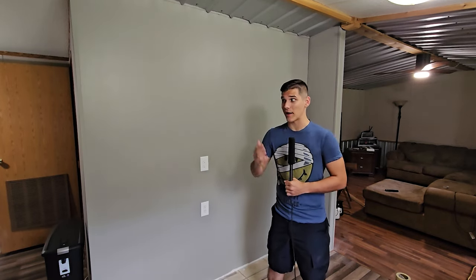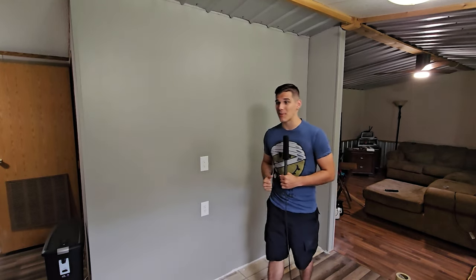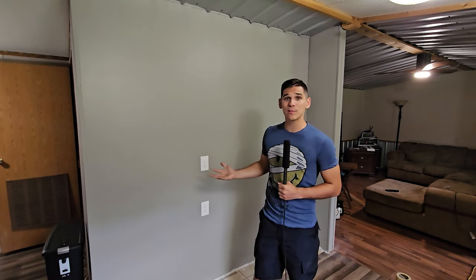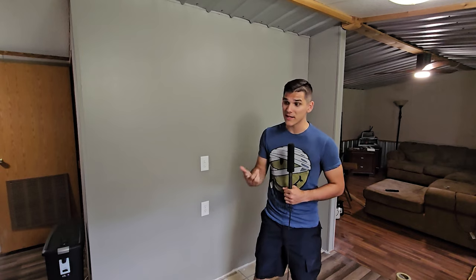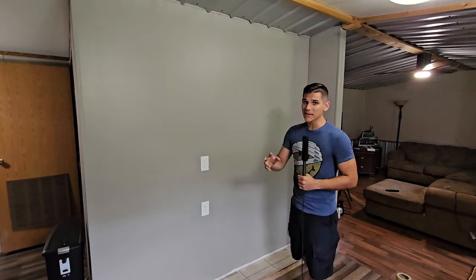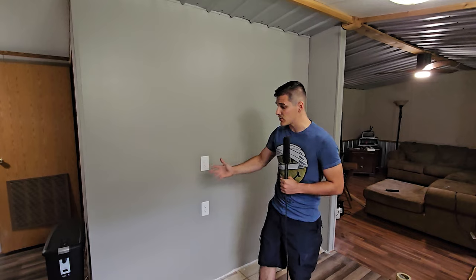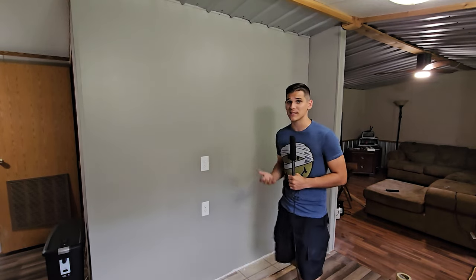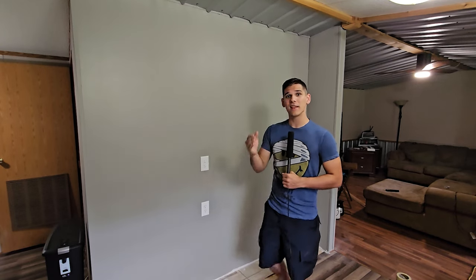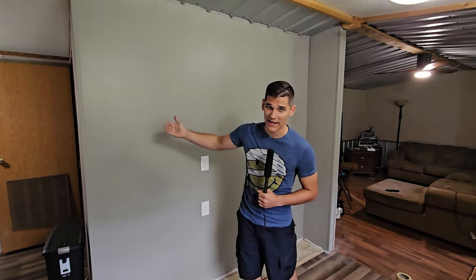Unless you happen to know how to make your own cabinetry, you're most likely going to have to order custom cabinets from some cabinet shop. Most of your standard mobile homes can also be referred to as manufactured homes because they are manufactured in a way very similar to an assembly line. What that means is when they're designing the mobile home, they're making everything custom to fit. So little quirky spaces like this don't have to stick to a specific manufactured standard measurement system because they're just going to make a whole bunch of cabinets for however many of these mobile homes they're going to make.